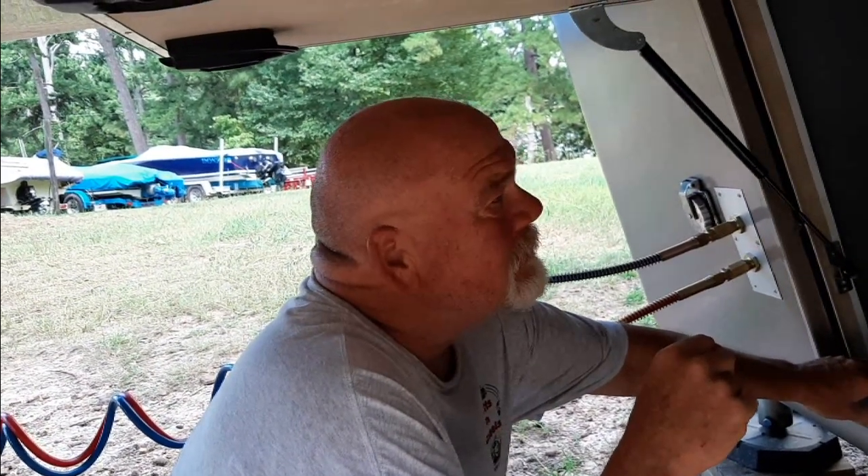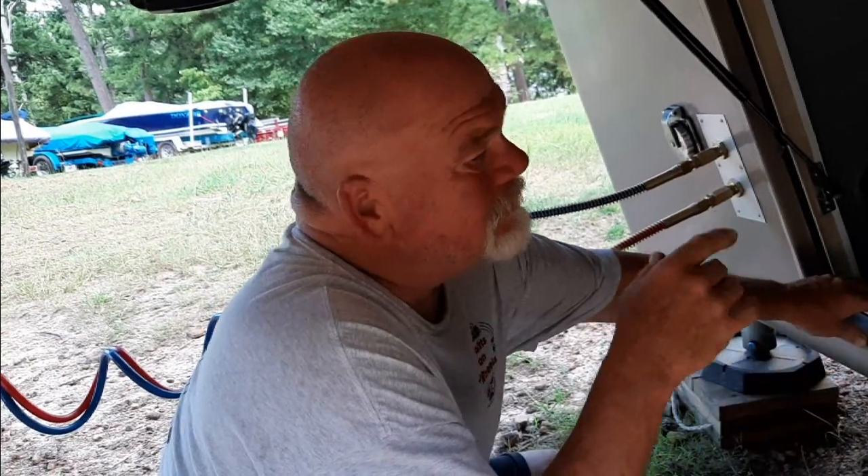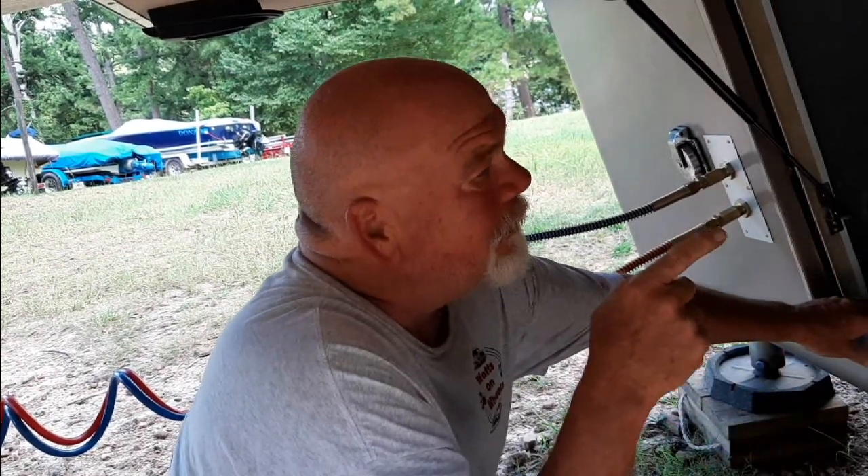It's just about 115, maybe 114. But what I'll do is after I disconnect and everything and get all set — I'm fairly confident this thing isn't going to roll away on me, I've got wheel chocks and all that — I'll open up that drain valve in the tank and bleed the pressure off so everything comes down to zero and the brakes aren't always applied.